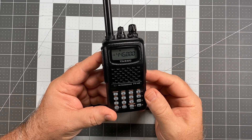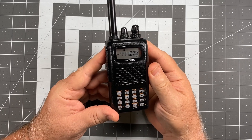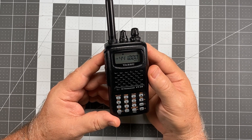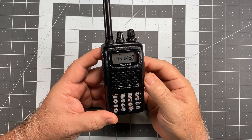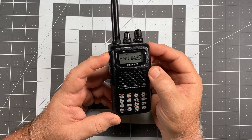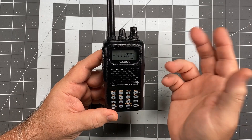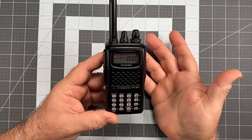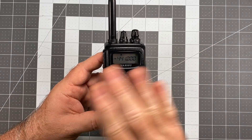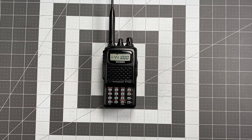Let's put another simplex frequency in — let's go to 436.025, which again is not going to be anybody's repeater frequency. It doesn't matter where you go in here; even though I've turned Automatic Repeater Shift off, I can't get rid of it because I turned it on at one point. Now for the life of the radio, it's going to continue doing this every time I try to do simplex operations within the 70-centimeter UHF band. That is a massive problem.